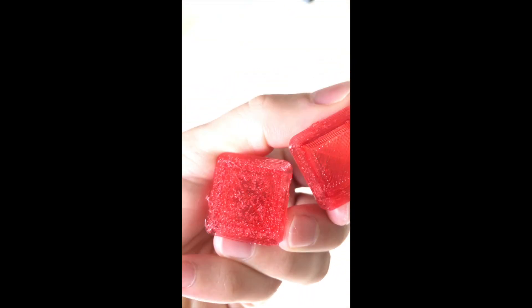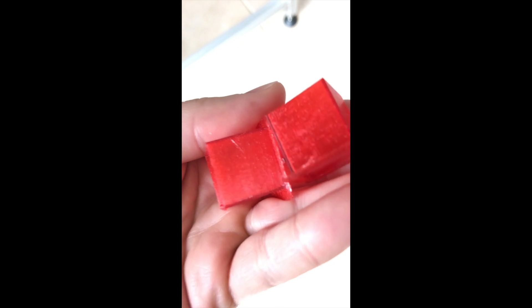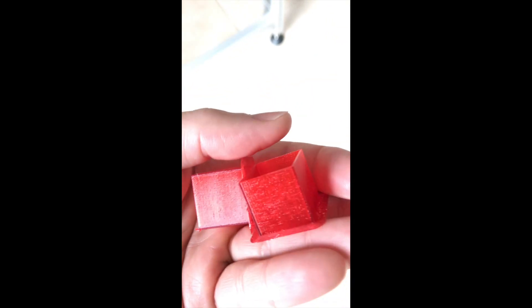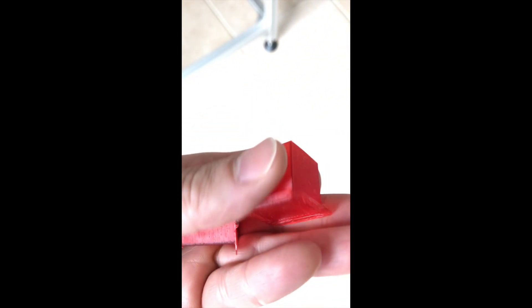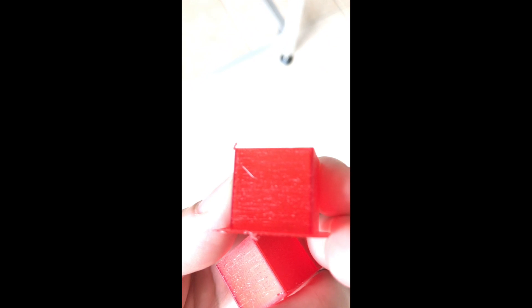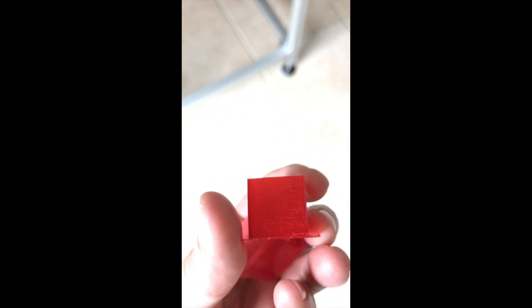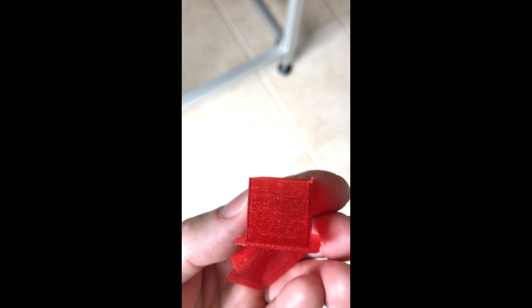You can see these two side by side — the one on the left is the totally wet, no-dryer one; on the right has the dryer. The sides — you can tell the totally wet one was definitely worse, but the one with the dryer on was still occasionally extruding a bubble every now and then because it was so waterlogged, and that shows itself a little bit in the print. But it's definitely improved from the totally wet one with no dryer. I initially started at 65°C and then turned it up to 70°C when I was extruding plastic to purge the lines.